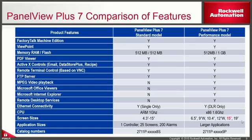This listing shows PanelView Plus 7 features for both standard and performance models. The PanelView Plus 7 standard lines up very closely with the PanelView Plus 6 compact, while the performance model aligns feature-wise with the PanelView Plus 6 with extended features — the key difference lies in the hardware. The standard now goes up to 15 inches, and the performance goes up to 19 inches. The performance has an X86 1.6 GHz processor for faster boot times, whereas the standard has an ARM 1 GHz processor.